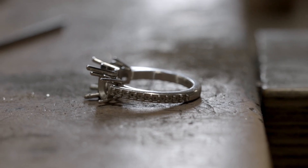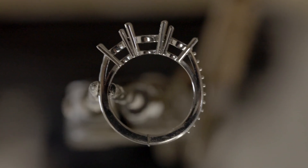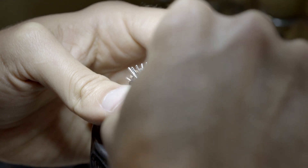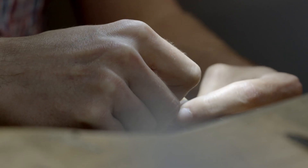If you go through too many cycles of rework, you can start losing your profiles. A lot of jewelry is very symmetrical, so you want to make sure those profiles are pristine. If you've got a lot of defects on one side and you're reworking and reworking, you can lose your profile and scrap that ring just because of that porosity. By applying HIP, you're just not going to have these issues.